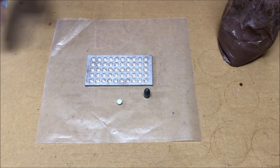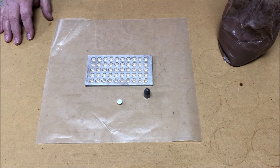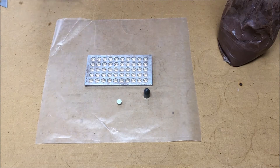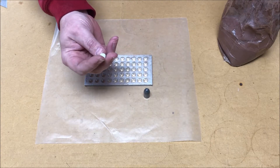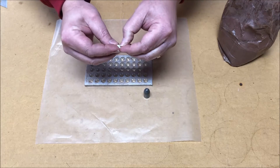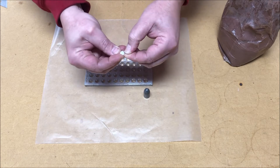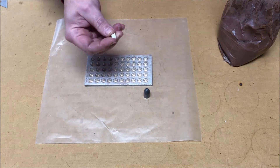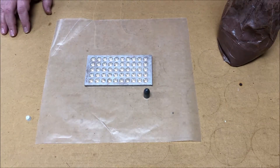So it works really well and makes good rock-hard plugs, but it was a little painful to work with. In the next video I tried Sculpey clay, which is not really a clay — I think it's some kind of polymer — basically a crafting clay you can fire in your oven at relatively low temperatures, something like 200 degrees. It works okay and has very little shrinkage, but it's not really that hard — it feels almost like a very hard pencil eraser and you can still crumble it with your thumbnail.